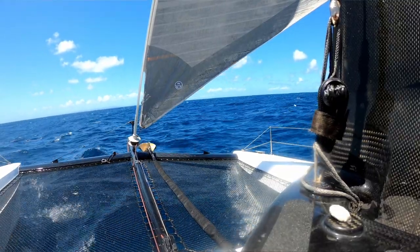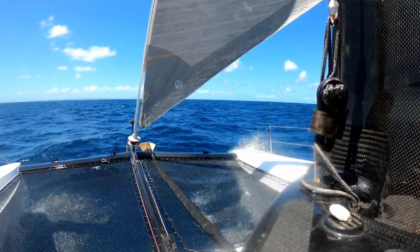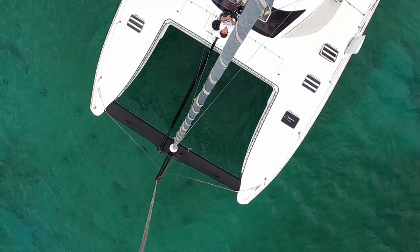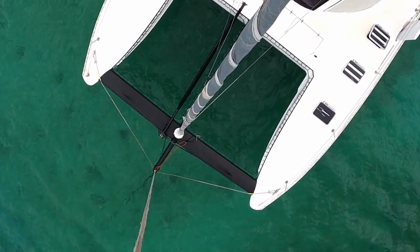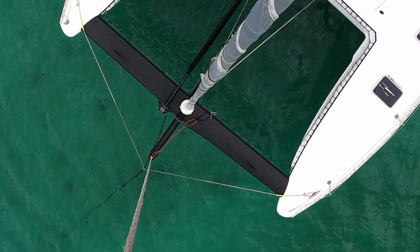With a swage eye, the wire is buried inside of the terminal and then squished, and that's what they call cold fused when they swage it. To remove it, you obviously have to chop that fitting off to bare wire, and that bury is usually about 250 millimeters on 12 mil wire, or half inch wire like ours. So you're always going to lose 250 millimeters on a wire of the size that we had, if you're going to replace the toggle fitting.